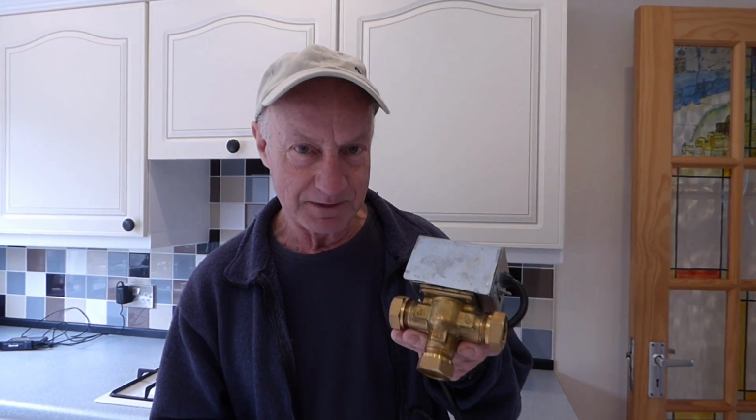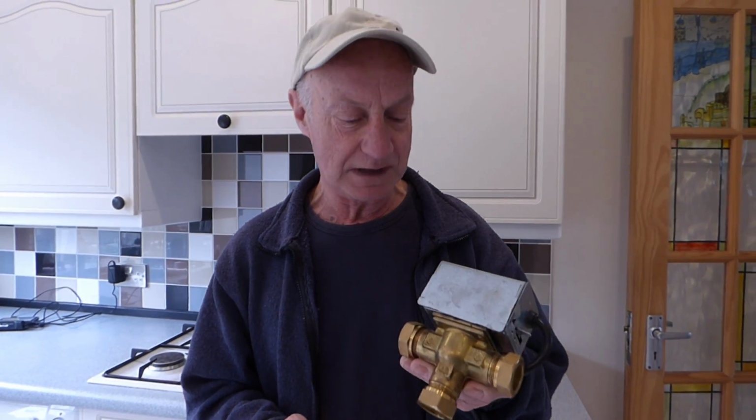If you've been having problems with your heating this year, one of the main ones has been a problem with one of these, the three-way valve. So all of you that got combi boilers, you can turn this video off. It's nothing to do with you. But if you've got an F&E system, by that I mean a copper tank in the airing cupboard and a little header tank, that's called an F&E system. If you've got one of those and you've suddenly found your heating is no longer working, you've switched it on, the thermostat's up, and it just isn't going. It was, and now it's not. A lot of times it will be one of these, the three-way valve. And I can show you a very simple fix for this that a lot of people don't know about.